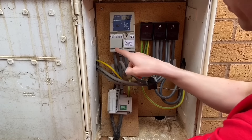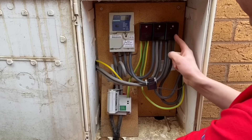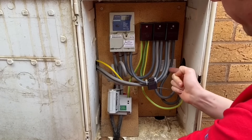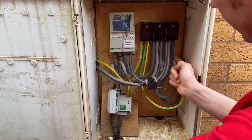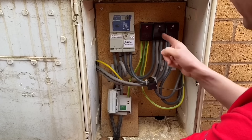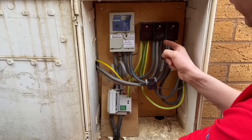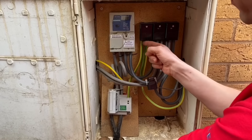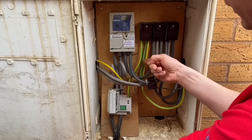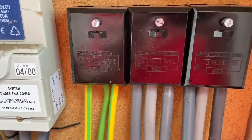Tracing through: the line meter tail comes into the bottom of the meter, the neutral comes into the bottom of the meter, and then the line meter tail comes out of the meter into a connector block mounted on the back plate. The original meter tail back to the first consumer unit has been reinstated, and the new meter tail to the new consumer unit has been put in place. A very similar thing has been done with the neutral tails — out of the meter into a new connector block, with the original neutral going to the original consumer unit and the new neutral going to the new consumer unit. The same applies to the earthing conductors — from the cutout service head into a connector block, with the original earth going to the original consumer unit and a new earth going to the new consumer unit.